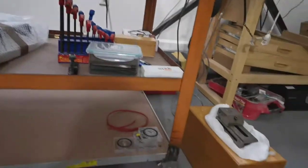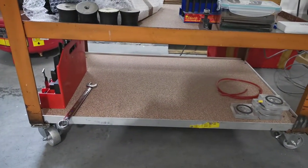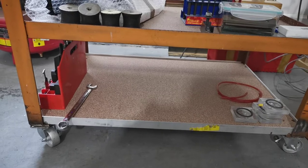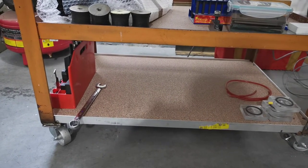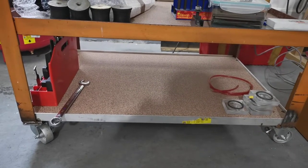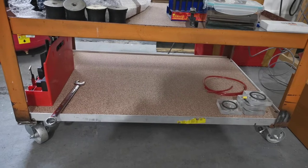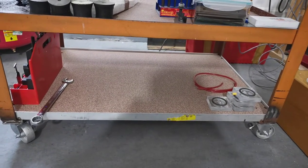I was very concerned about the bottom legs here. They stuck out a bit too far considering how heavy this machine is, and they bent a little bit whenever I pushed the machine around. So I added an extra shelf at the bottom that is screwed directly to the wheel mounts to stiffen up the whole thing.